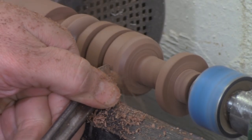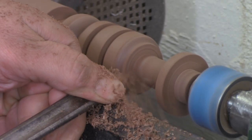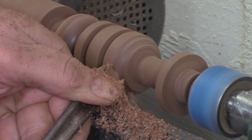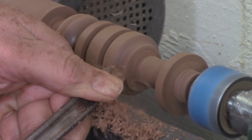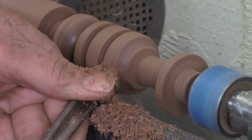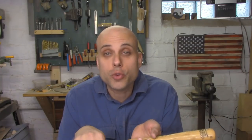Making a cove is the exact opposite. You start with the gouge in the closed position with the flute at 90 degrees. You go in at a straight 90-degree angle, and then slowly roll the gouge on its bevel over until you have the flute open or facing up — and that will give you a cove. This is a super quick overview of the tool; I'll link to a couple of better videos in the description where really expert spindle turners can show you all the nuances of coves and beads.